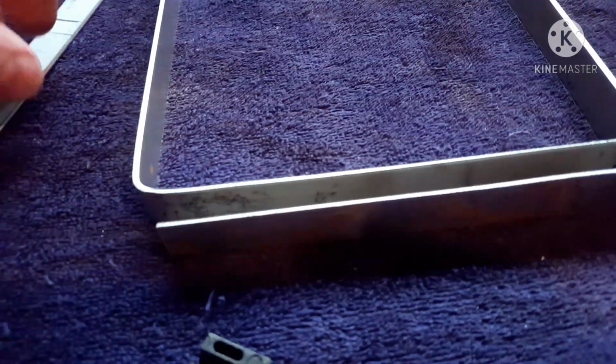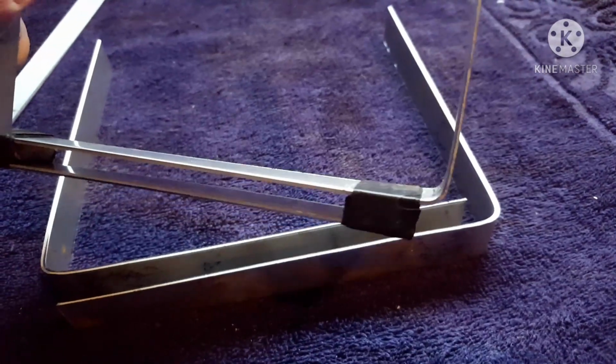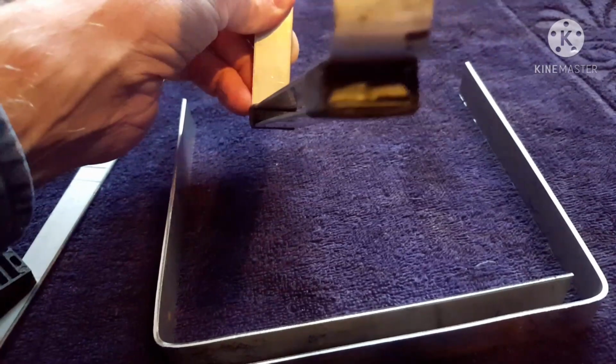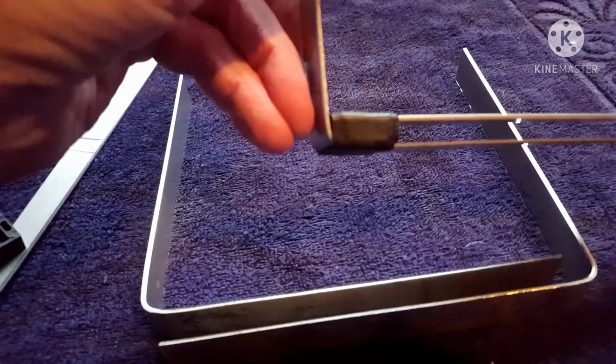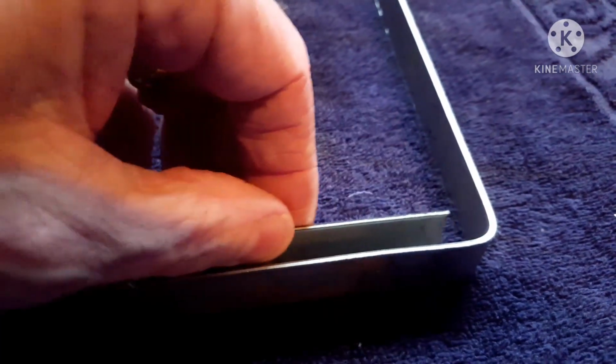One thing that's important on this is how you tape up the ends. You can see here it looks like I just threw tape on there, but there's a little secret to it, in that the bottom electrode, the end of it is taped off on both of these. And the reason for this is, if you look at this, the current, when you put this under the water, if that end of this is not taped off, it will actually cause corrosion to occur here and will actually chew all the way through that electrode.